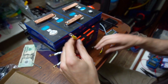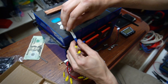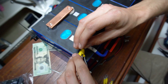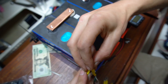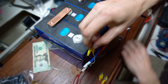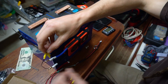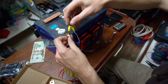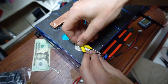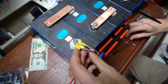We're going to take the negatives of both — the white one and this one — and hook them up together. The least amount of power is going to go at the top and the most at the bottom. I've got this little gray one just going to the capacity controller — that's not drawing any power, it's just checking voltages, so that's on top. Then I've got my balance lead and finally the B negative.